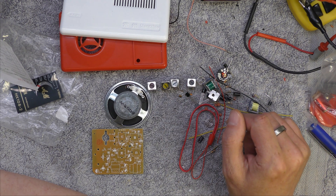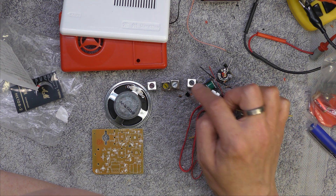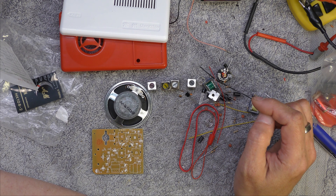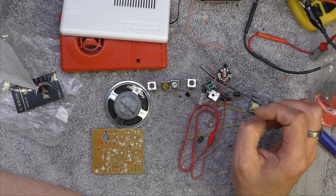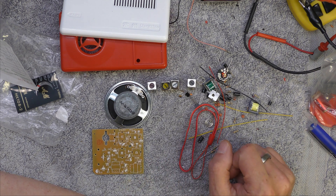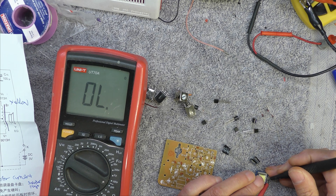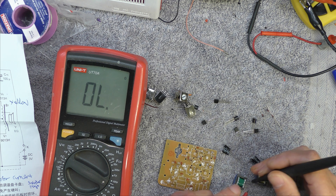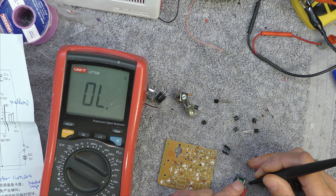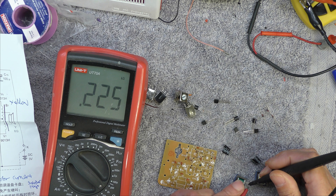Most things seem to work with those sort of colours for AM, so the diagram does show the oscillator positions. I was wondering which transformer was which, but it's easy to tell because the output transformer B7 has a very low resistance compared to the driver transformer. So the output transformer is the yellow one, B7.